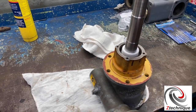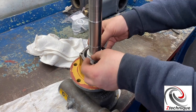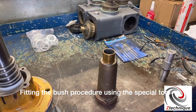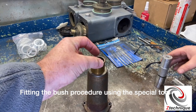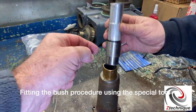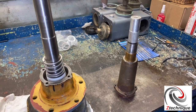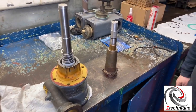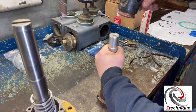These are made out of Teflon, with a steel retaining ring that goes on the spring. If you're in the field, we're going to show you a method using a hammer and a tool that sits inside here and goes to the outer shoulder, so you get a good pressing effect. Of course if you're in your own workshop you might be better using a hydraulic press to get it absolutely square first time. We're going to demonstrate using the hammer method — make sure it's absolutely square.